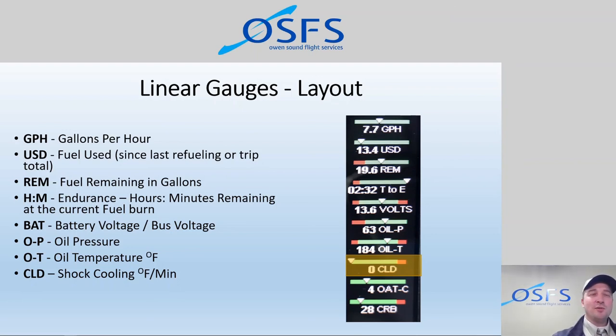So next time, we take 4 or 5 seconds to get from cruise to idle instead of 1 or 2 seconds. And all those little changes in our practice and procedure add to the longevity of the engine overall and the cost of operating overall, which in turn translates into the cost of learning to fly, because if it costs us less to operate, then it costs you less to learn to fly, and that's just the bottom line.